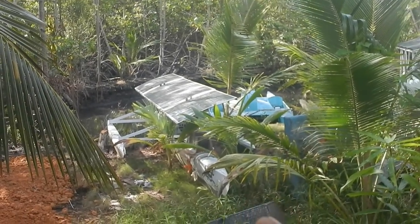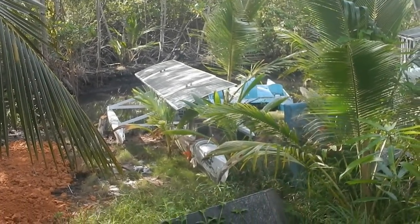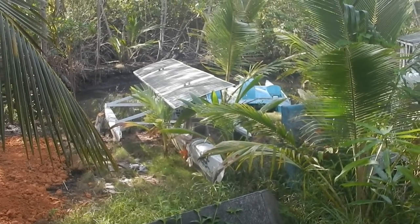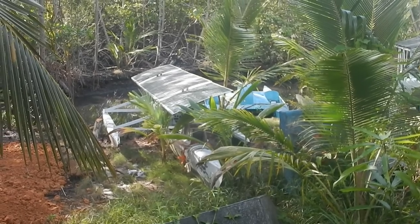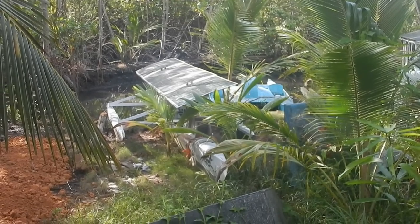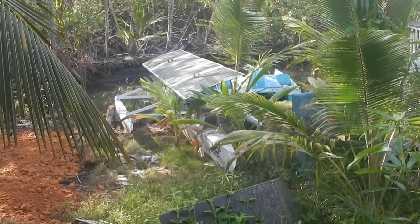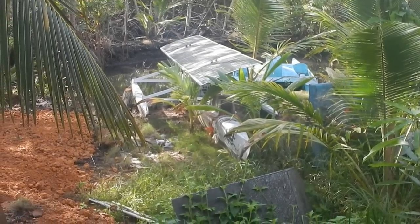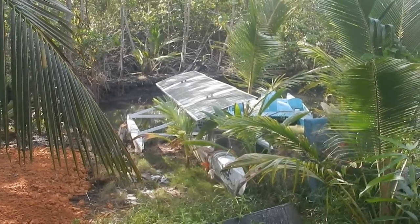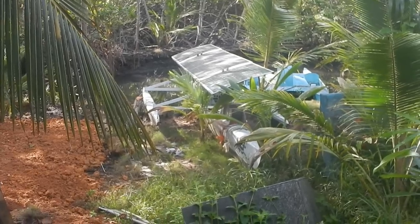So this boat, with the battery in it right now, which is a 100 amp hour, 24 volt SOK battery, that's the brand, SOK. They're supposed to be high quality, will actually do what they're rated for, at least. So the motor only uses 39 amps, let's round it up to 40. 100 amp hours means this thing will run full speed for 2.5 hours in the dark, with no sun help at all. And the solar panels will give me something like 25 to 30 amps. But let's say I can count on 20 amps in decent sun. That's basically half the power of the full power motor.